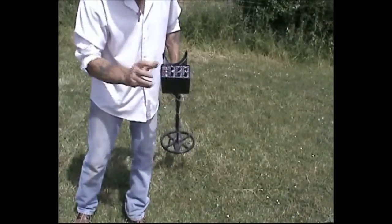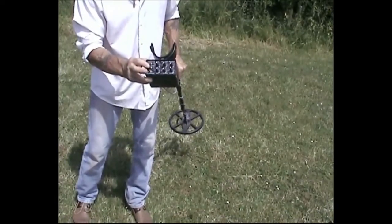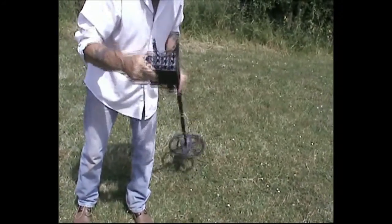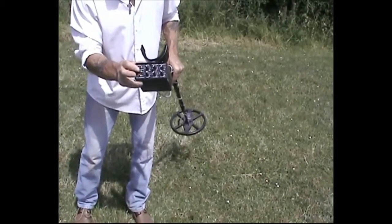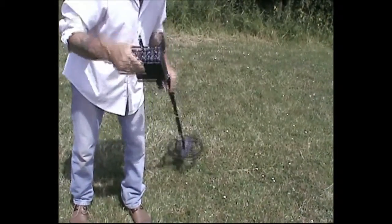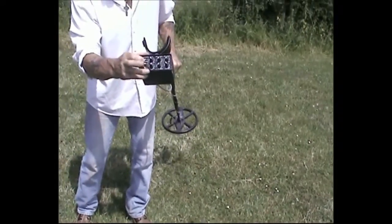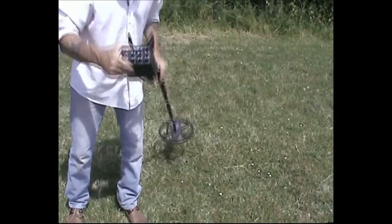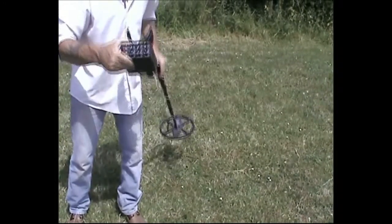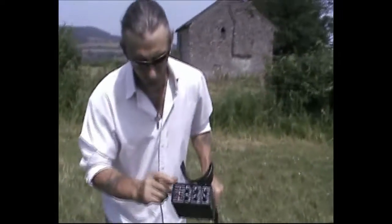I'm just going to show you now. I would leave it at that, but I'm going to show you what happens in zone 1. Let's see what happens in auto zone 1. Okay, noisy. Zone 3. Okay, we're going back to zone 2, the quietest zone. There, she's just going to come around. There we are. She's ground balanced in there now. That's how to ground balance in auto zones.